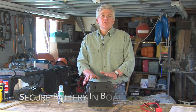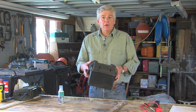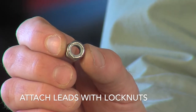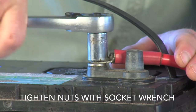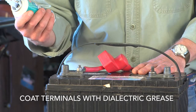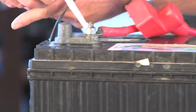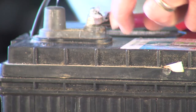Install it properly with bands or straps to keep it from moving around in the boat, and protect it with a battery box like this one as well. When it's time to attach the leads, use nylon insert lock nuts, not wing nuts which can loosen up during the season. Also, tighten it down using a socket wrench. Once everything is tight and secure, cover the terminal posts and leads with dielectric grease like this one made by CRC — this will protect it from the elements during the season.